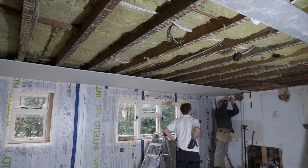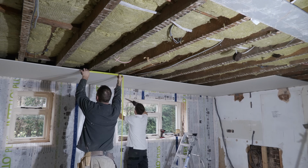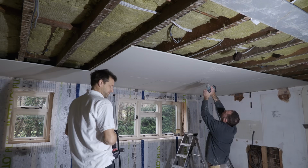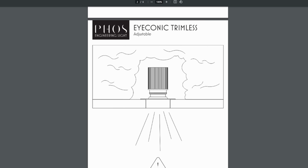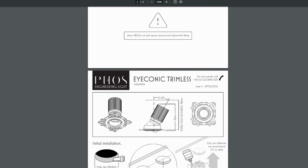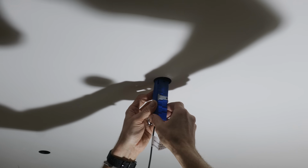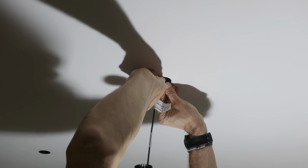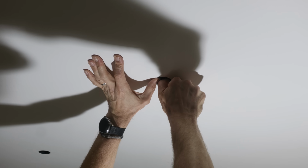We put rock wool in the ceiling to try and dampen sound travelling from the kitchen upstairs. What this has done is reduce the ceiling space. The downlights require a total void of 98mm, which is partly to guarantee enough space for the heat to dissipate properly from the heatsink in the light, but also because any less than this and you'll struggle to get the transformers up into the ceiling space. You can't put the transformers up beforehand, as then you can't connect the downlights to them, and you might need to remove them later down the line anyway if they fail. Anyway, suffice to say I was right on the limit in terms of the void space.